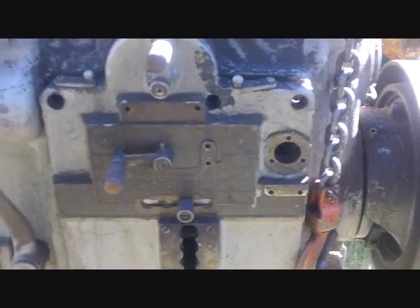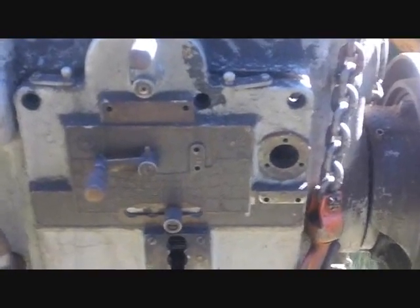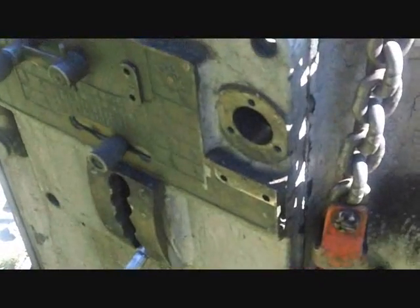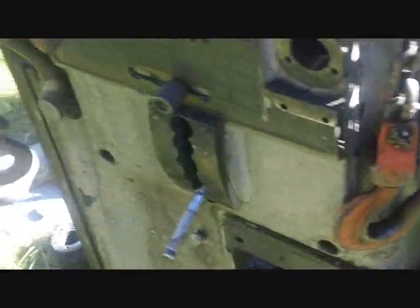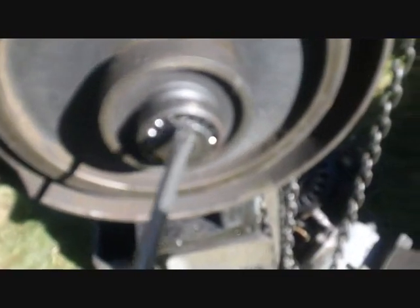Maybe now I can take this whole side off. When I pry on this, you can see how it's wiggling that whole pulley right there — so that means when I'm pulling out on this, this whole shaft that goes into here is being pulled on. Maybe this shaft has to be removed before this can be taken off. I just removed a little spring wire clip that was in this groove — the bottom of it actually bent up at 90 degrees and went up through a tiny hole in here. I think the purpose is to lock this, which is like a nut — you can actually see there are threads on this, so this must need a spanner wrench to take that off.